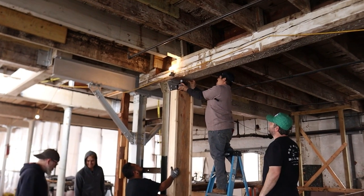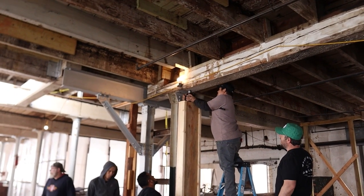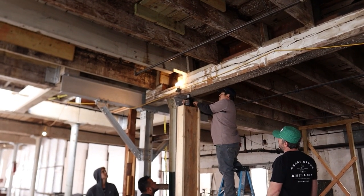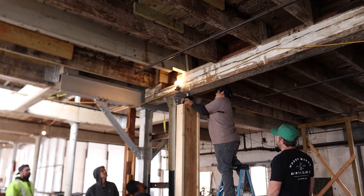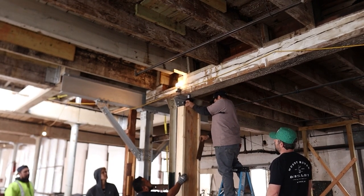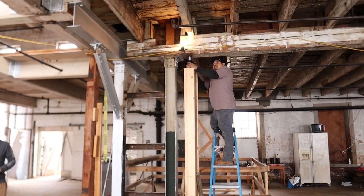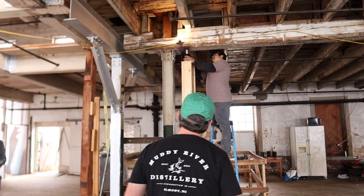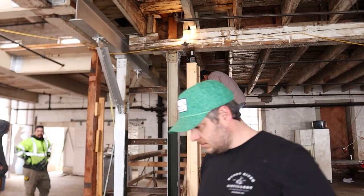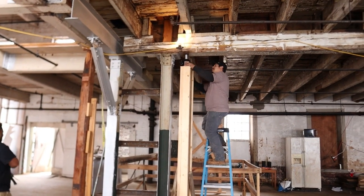The jack post is in place. So Arturo is taking a 20-ton jack and putting it up on top of the jack post and then putting tension on the whole rig. He's pumping it up right there. He's then realizing that you have to lower it down, which he'll do, and then screw the leveling post. So you try to get as high as you can by screwing the jack, inside screw up first. Because right there, that jack is about fully extended, meaning you can't really lift that floor any more than it is. So I'll take it back. Well, we did that a lot.